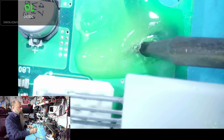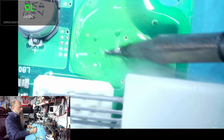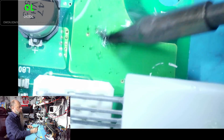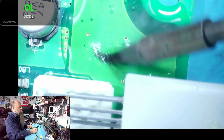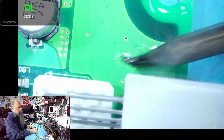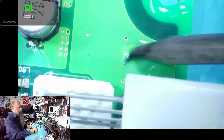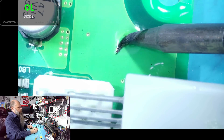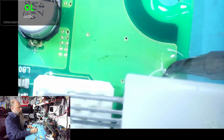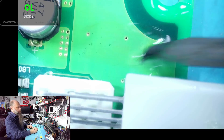Now let's burn it off. As you can see, it's not boiling — there's a little bit of boiling action but essentially not boiling like the other ones. It doesn't burn. It keeps the soldering tip nice and clean — it doesn't form this black soot on the soldering iron. My previous blend would be starting to turn brown now, but as you can see this one's not turning brown. It's perfectly clear so you can see what you're working on. Still no burning — this was quite a few seconds of heating and no signs of burning.